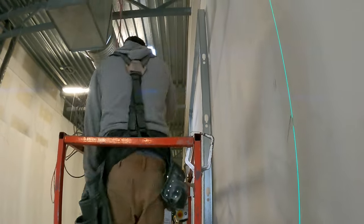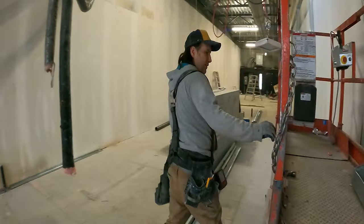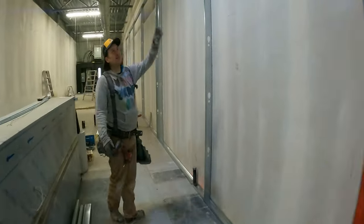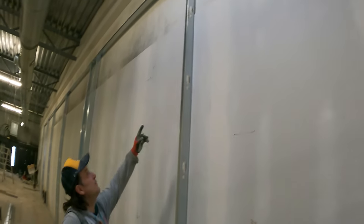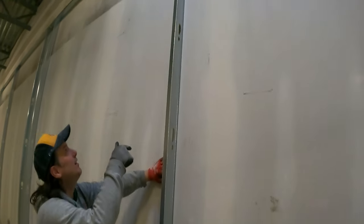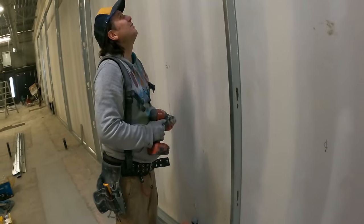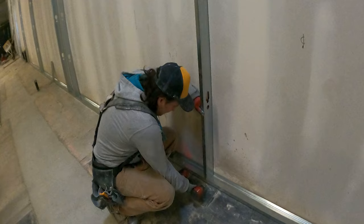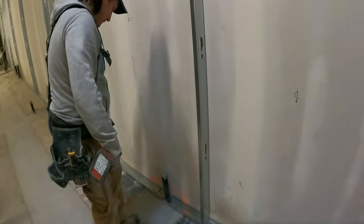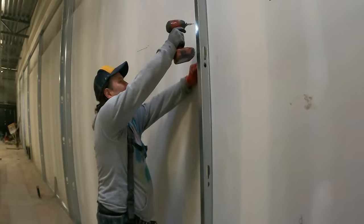You can see we have the shell laid out. I'm joining it mostly with those little six-inch pieces of steel — you can see them on the top track. These studs I am screwing in to the wall as well. I need to come back and screw these all off, and I'm putting inch-and-a-quarters in them to hold the wall in.